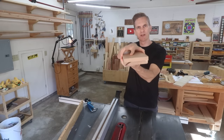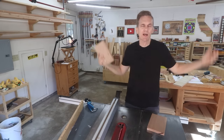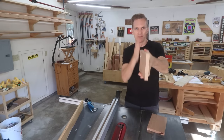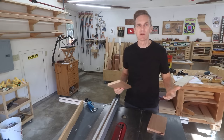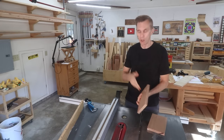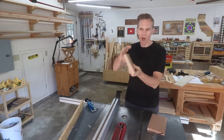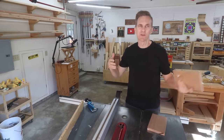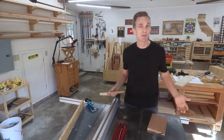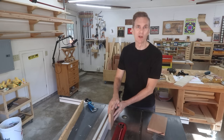I need to make the book covers much thinner than this three-quarter inch wood. One way to do that would be to use a thickness planer but that would waste a lot of wood. So typically you'd want to re-saw this board — in other words, slice it this way into two thinner boards. A band saw would be the most common tool for this job, but if you don't have a band saw you can re-saw with a table saw. I already did that earlier to thin down the spine. But cutting a wide board like this poses more challenges, especially if you want to do it safely. You just need to think through the setup and how the board is going to be supported through the entire cut.